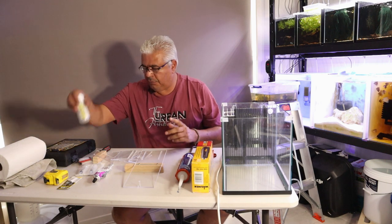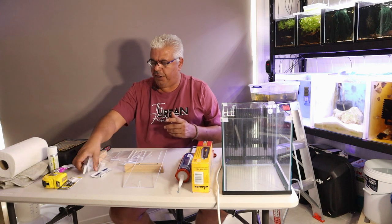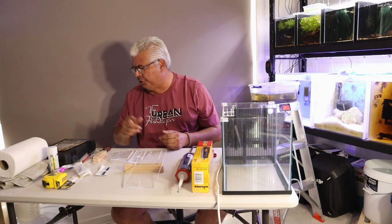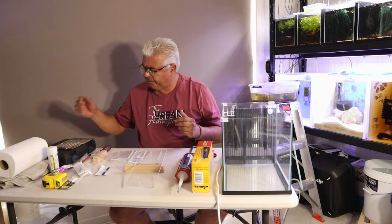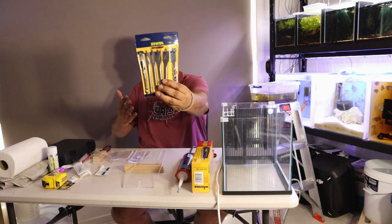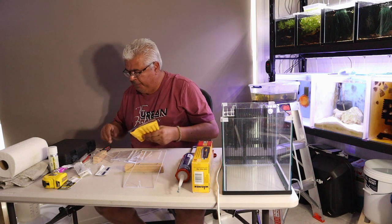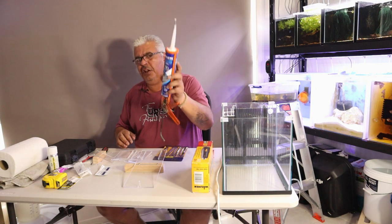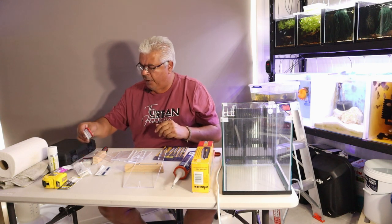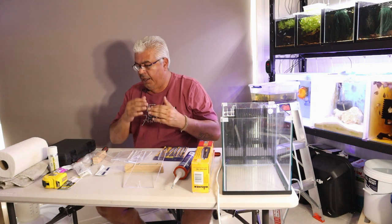From a requirements point of view: for acrylic bonding you need Acribond and Acrifix, a tape measure, something to clean with, alcohol swabs to clean off acrylic edges, syringes and needles, a drill with hole saws for the fittings, a screwdriver, and a little bit of silicone for the fitting on the outside box. I've also got nylon nuts and bolts — I'll show you where those go. The other thing I've got is a tap and die set. You don't need to buy a full set — just the size you want for the screw at the bottom. In my case I used a 3mm.